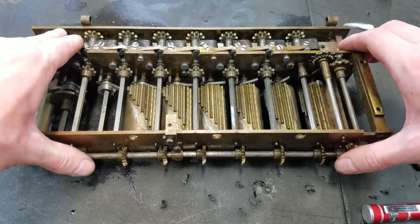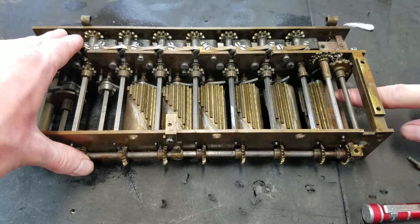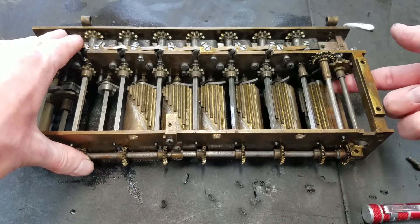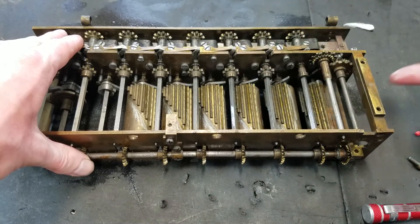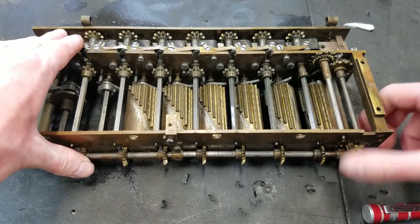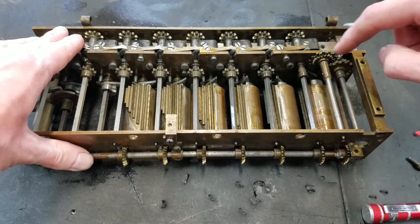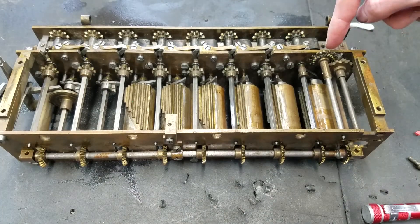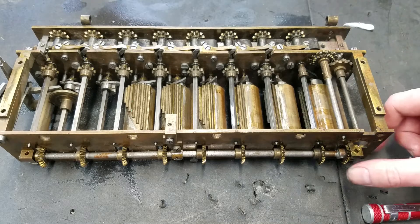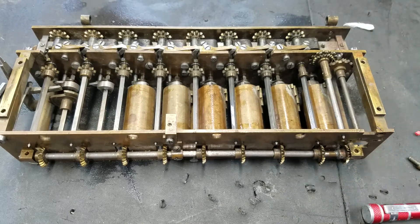What it's hitting now is the counter increment. There's another finger similar to these fingers on this first drum, because there is no carry input from this side — there's nothing over here. Instead of that finger being the carry like it is on the rest of the drums, it's actually fixed to always engage, and that's the counter increment. So that finger will engage with one of the teeth here and push that forward one position. The top side of this engages with the counter digit in that position to turn that one position forward as that finger passes by on the bottom.